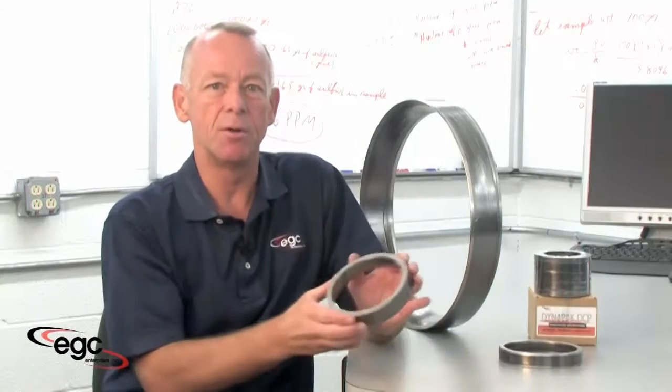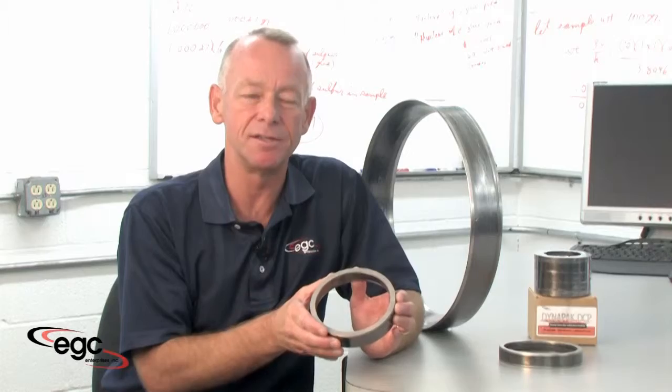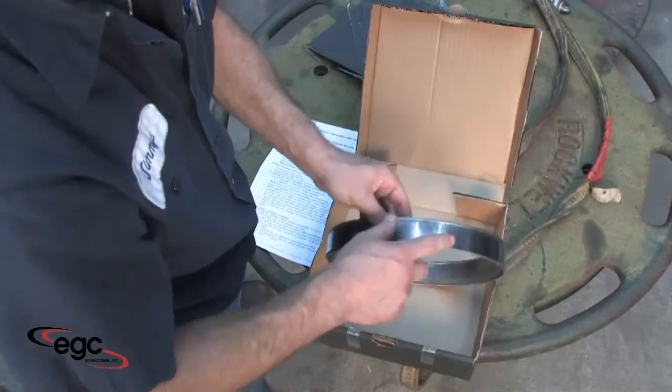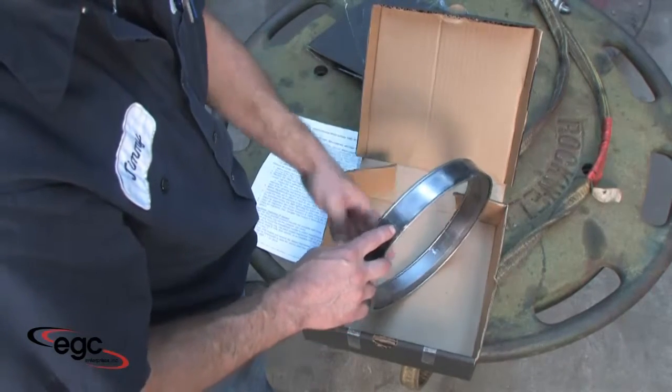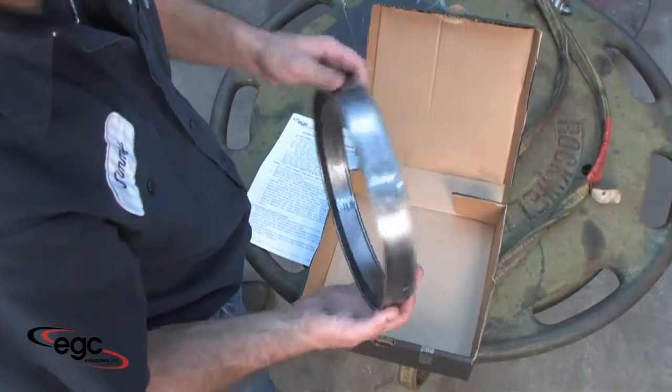Installation of the VSG Pro is simple, but very important. So there are a few specific guidelines that you must follow. The VSG Pro is wrapped with a few strands of cellophane tape. The tape holds the metal components to the seal and should not be removed. Once the system hits operating pressure, this tape will disappear.